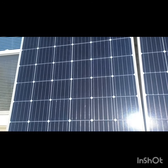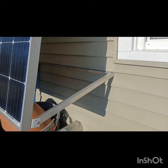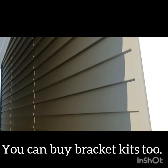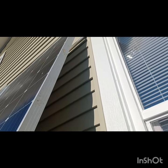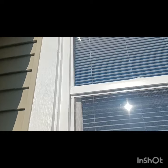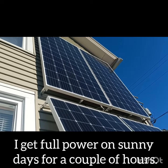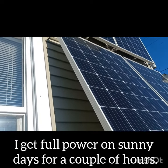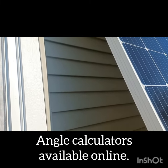Like I said, they're 370-watt panels. You can see I mounted them on the house. I made up my own aluminum brackets here. I put a little space between the house and the panels just for airflow. The ones up top, you can see I got them mounted flat. Now, people say you've got to angle them towards the sun — well, you lose a little bit. There's plenty of research that shows you don't lose a lot. These are pretty close to an ideal angle for wintertime, and I've had them in summer too; they work just fine.